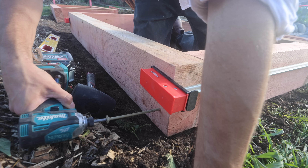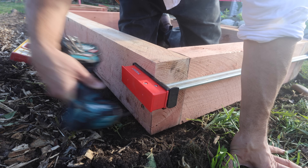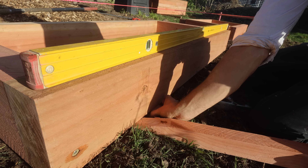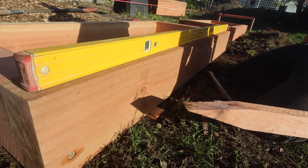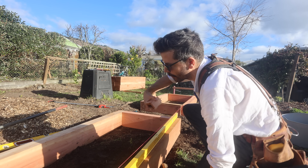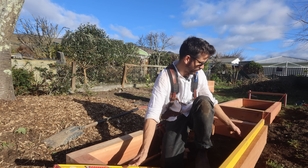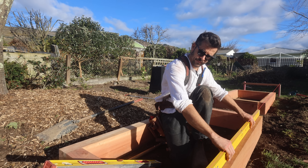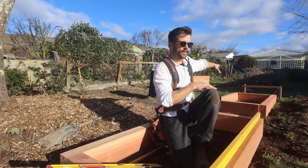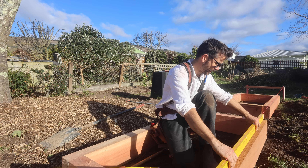So now that it's like a unit, you can lift it up and get it nice and level with some packers, just for the time being. You want to do this after the first row is screwed together rather than waiting until you've got a big box — that's very heavy. Now, they are just planter boxes; you don't really have to make them dead level. But because they're rectangular structures, and if there are two of them connected, you're going to see it going askew, so I want it nice and level.